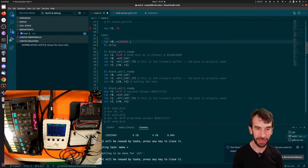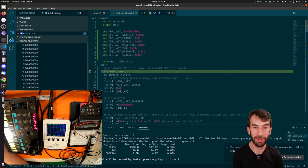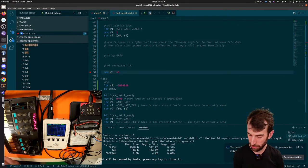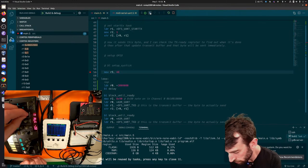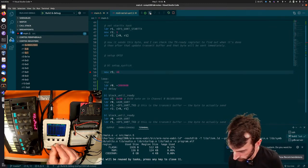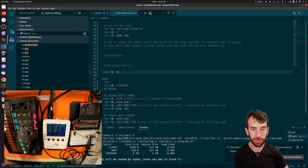Okay, I'll set a delay here of 3 million, same as what we were doing last time. The BL delay is a bit difficult to work out exactly how many cycles that is. There we go. So there's my notes coming on the wire. The same three bytes I was sending last time.